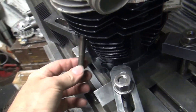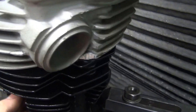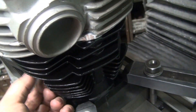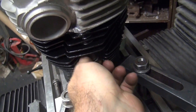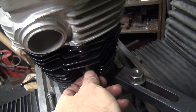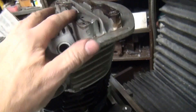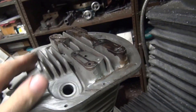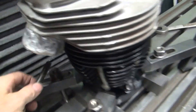Right now I'm going to put all these head bolts in here and tighten them down. I don't have any head gasket on here, so everything will sit flat. I deburred everything so you won't have anything being uneven on top. If you had a head gasket, head gaskets don't pull down evenly and you can easily get a couple of thou from side to side. Without a gasket is our best option for being square and straight.